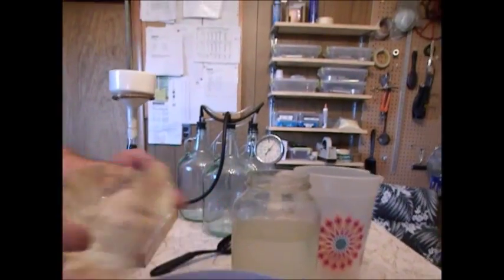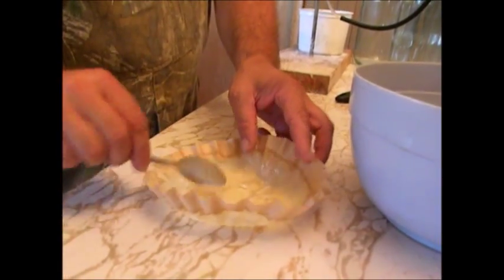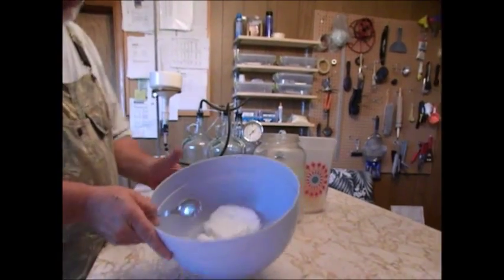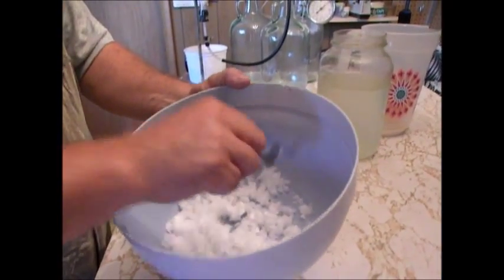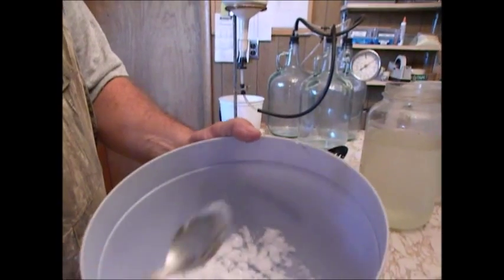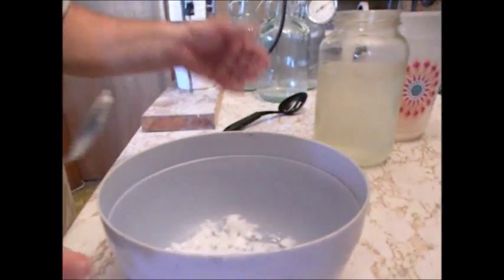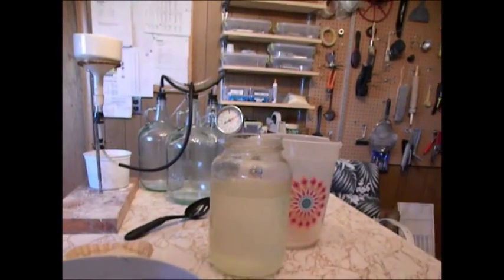In this case I just dump it in there and I'm going to reuse this filter again. You can scrape it off if you want — if you're going to re-filter it again, it really doesn't matter. But that's what you end up with. It's still pretty damp but it flicks apart pretty nice. Tomorrow I'm going to do a purification process and we'll tape that for you too. I'll just put it in the window and it'll dry real nice. That's what we do as far as harvesting it. You just repeat the process until all the chlorate is out of the solution. We'll catch you when we come back and do the next segment.